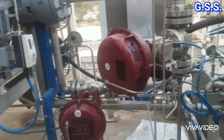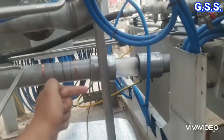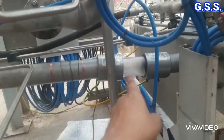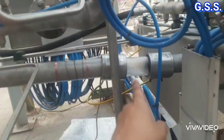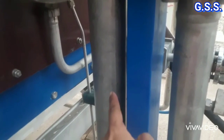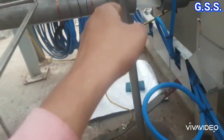This is a 2-inch stainless steel lube oil piping of a compressor, and this is the lube oil return line to the lube oil tank. On this lube oil return line, this sight glass has been installed using strap grip coupling on both sides. When lube oil enters the sight glass, electric spark is being generated. This is dangerous because the return lube oil is hot and contains lube oil vapour, from which fire can occur in the entire lube oil unit.